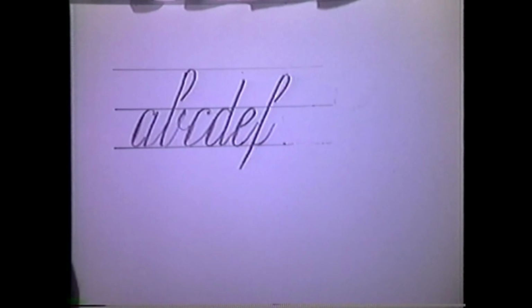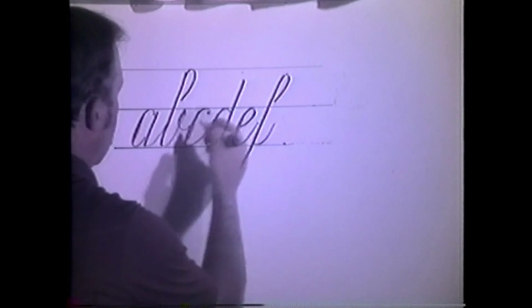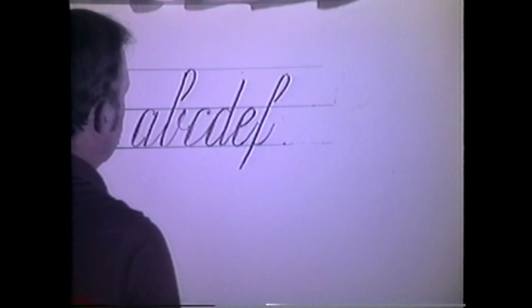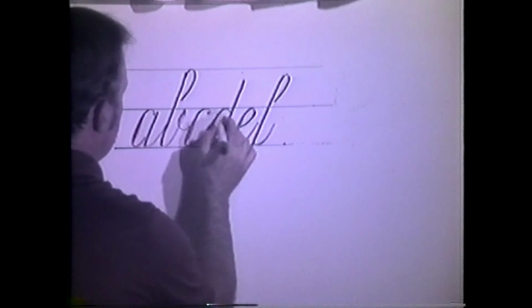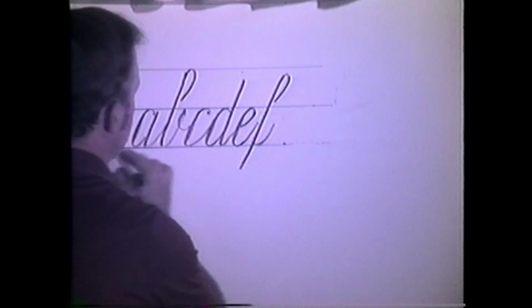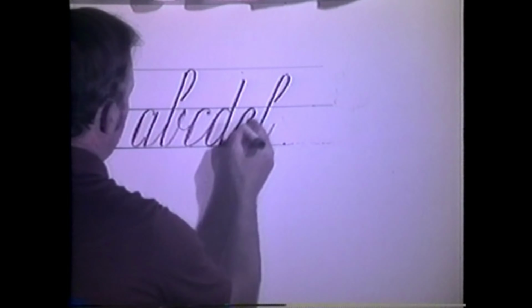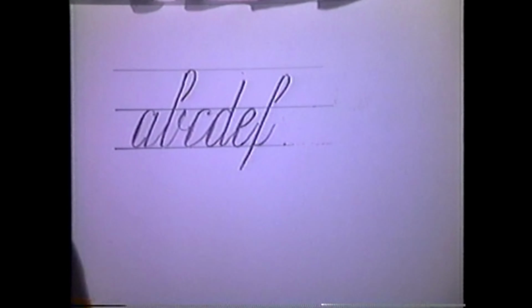And then when you get ready to cut it, normally if there's just one line, I'll go ahead and cut it. If there's more than one line, I'll sometimes scribe on those skeletons, or I'll have to scribe the whole letter, because once you wipe it off, you can't put guidelines by scribing them, because you don't want those left on the metal. But you'll have to scribe the whole letter. If you've got 3 or 4 lines, that's almost the only way you can do that sometimes, because if you don't, you're going to end up rubbing off some of your layout.